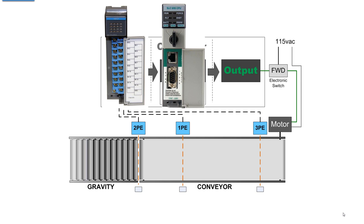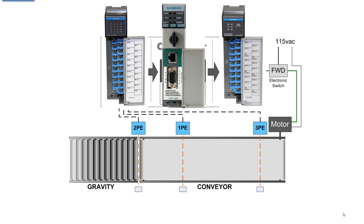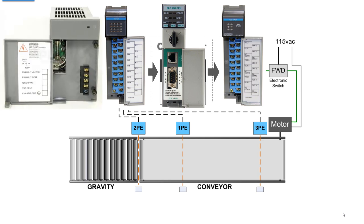To the processor, we have to add an input module or card with terminals that the photo eyes connect to — we'll cover sensor and output device wiring in a later Factory Rat presentation. We also need an output module with screw terminals. So there we have the three items, and all three of these need something you don't see there: they need a power supply.